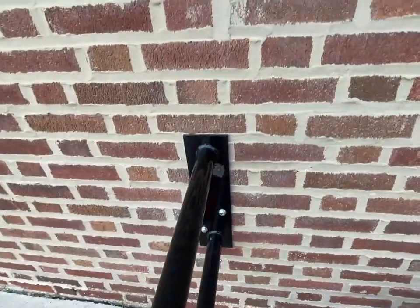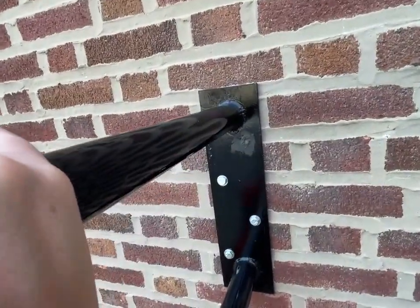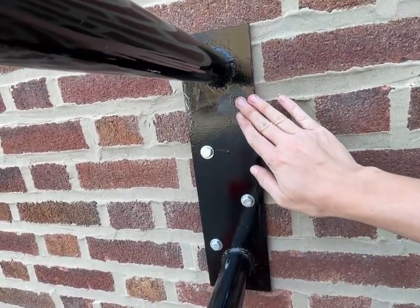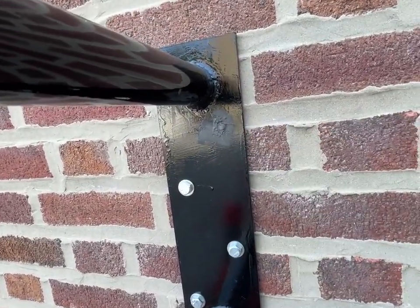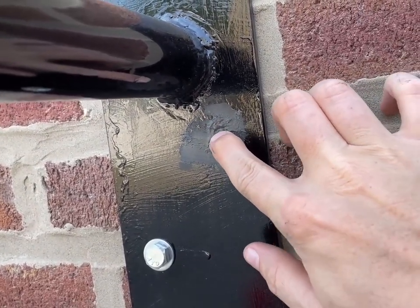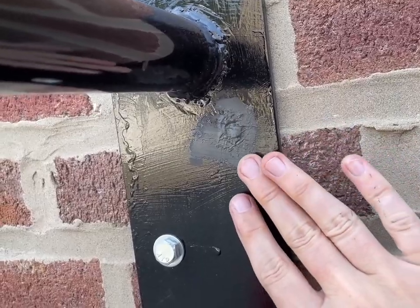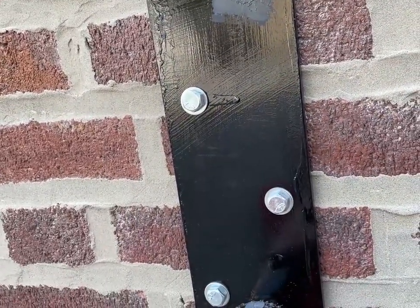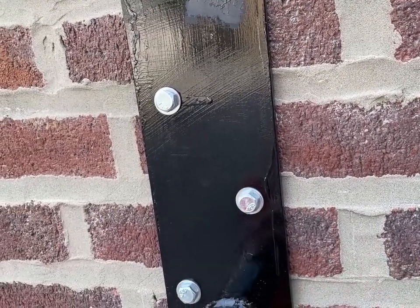Just in case I didn't say this already — I talked to the client and he said that these three bolts are more than good enough, and I should just cover over this. With successive layers, I filled that in with JB Weld and I've given it a few days to dry. Now I'm going to skim it a little bit and then paint over all of these so that they don't rust up.